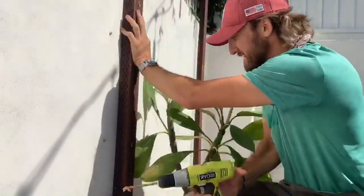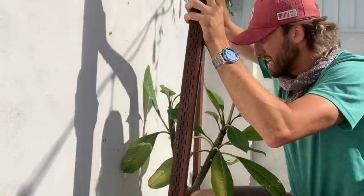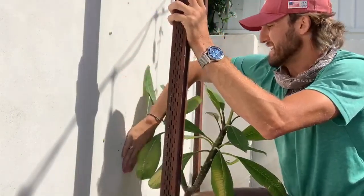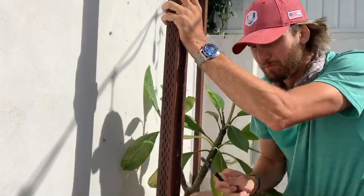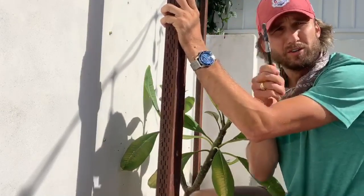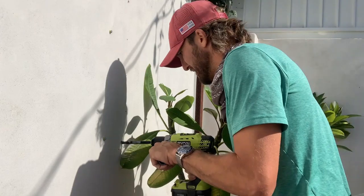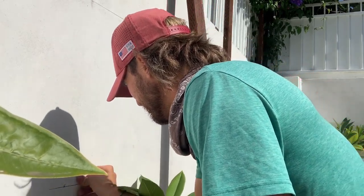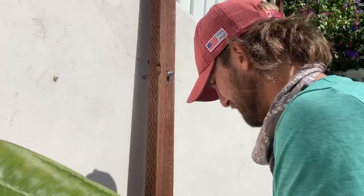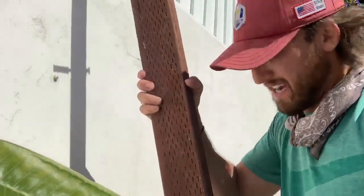Second board is now square and level on the wall. My board is square and level and I know exactly where the hole needs to go, so now I'm just going to drill my pilot hole. Now that my countersinks are in, I'll switch the drill bits to my pilot hole bit into the wall. With any luck there should be an indentation on the wall exactly where my lag screws should go in — and there is. Now I know exactly where to screw in with my masonry bit.